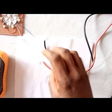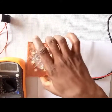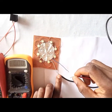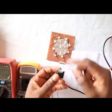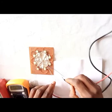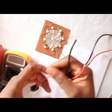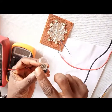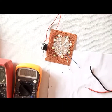My meters are now ready. These are terminals from my battery power supply — across these terminals I have 12 volts. This one is a light-emitting diode and this one is an incandescent bulb. LEDs have polarity, so I'm careful to connect negative to negative and positive to positive — if I reverse it, it won't light up. Incandescent bulbs don't have polarity, so you can connect them any way you like and they'll still light up. We expect the incandescent bulb to draw more current.